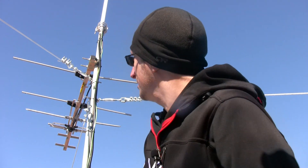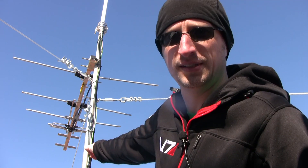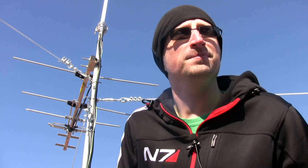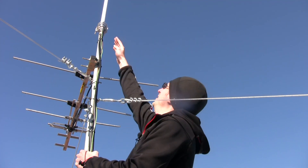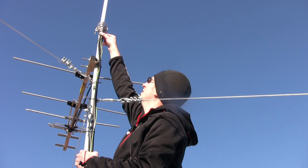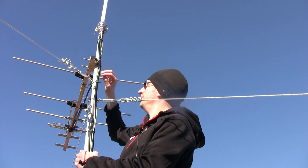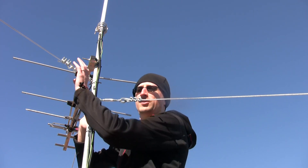To recap: I've got the RAK 8 dBi antenna connected directly to the lightning arrester, and then there's a green grounding wire that goes right to the lightning arrester. So up here: RAK 8 dBi antenna, lightning arrester, grounding wire, with the LMR-400 cable coming down from there. Everything is zip-tied and tight so it's not going to rub in the wind — that's wear and tear on the wires you want to watch out for.